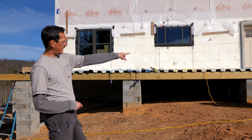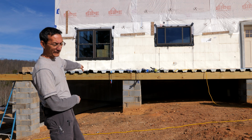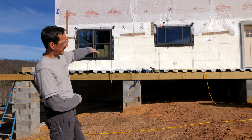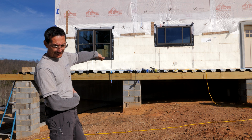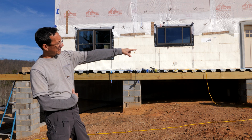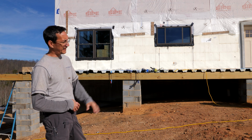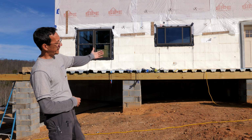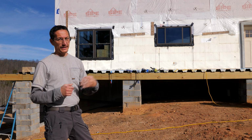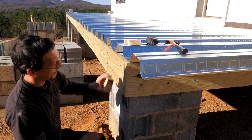So I started at that end. I'm now here. I am screwing them into the steel I-beam with self-tapping metal screws. I'm fastening them to the brick ledge with tap cons because we can't really weld over there. We'll melt plastic. We're going to come back and puddle weld to the beam, and that'll hold everything in place. Then we got to build forms so that the concrete doesn't just run off. So we got a lot of work left. I'm gonna try and get it done in the next 4 days. Let's get to work.